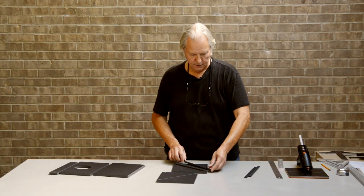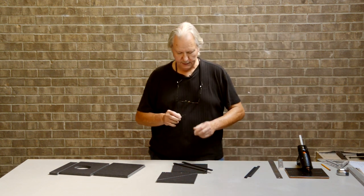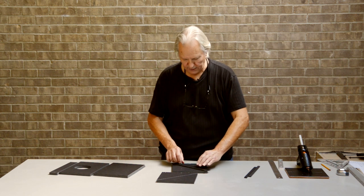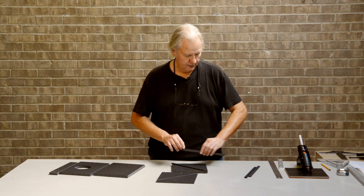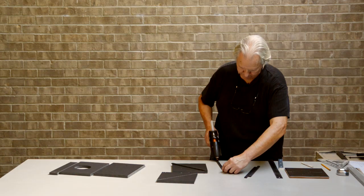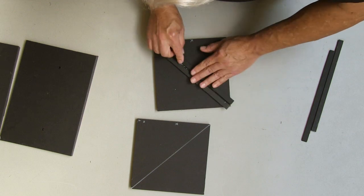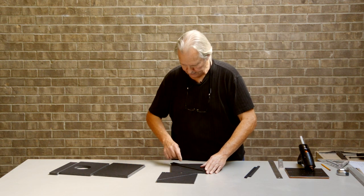It's time to place the second strip. What I've done is grabbed a twist drill from my drill kit that is a little bit larger — the next size up from an eighth of an inch, which is the thickness of the mirror glass we've got. I'm going to lay that right down in the middle there, and that way when I push the strip up close to it, I won't get it so close that the glass won't slip in. Run a nice little strip of hot glue down the track, bring that up just where it just touches the drill, then slide that drill right out of there.